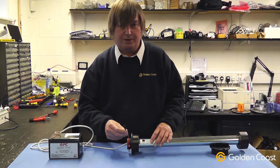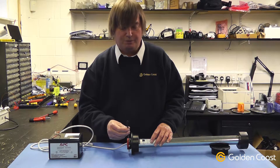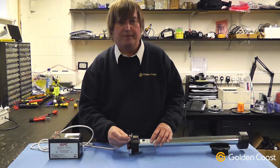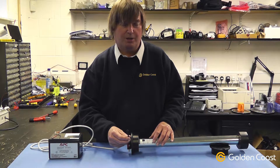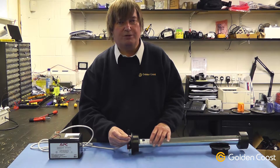No other key must be used, and this key must never under any circumstances be put into a power tool. If you try to use a power tool to adjust the stops, it's very possible that you would drive the switch mechanism off the end of the adjustment, and if you did manage to do this, the whole motor is then ruined.